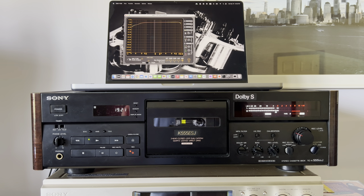That Dragon deck had polypropylene capacitors installed and it did sound incredible. So my next goal is to find a new, sealed Dragon deck, replace the capacitors with polypropylene ones, and achieve the best possible results. I know Dolby should work fine, but I'd never encountered a deck where I couldn't feel the presence of the Dolby system — until now. Even with a Nakamichi DR-1 or Nakamichi Dragon, I was always able to hear that breathing effect when the Dolby circuit closes on the highs.